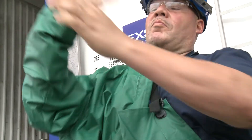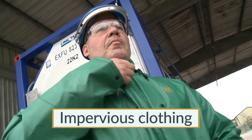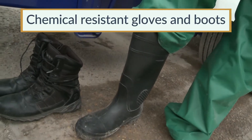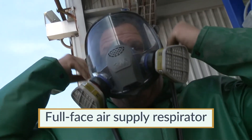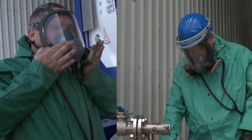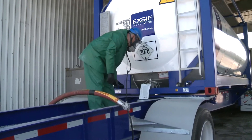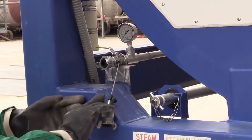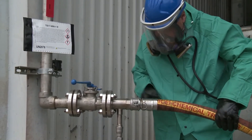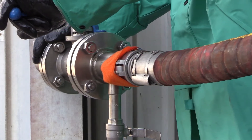In order to avoid contact or exposure to TDI, wear personal protective equipment during hookup and disconnect activities. This includes appropriate impervious clothing, such as a chemical protective suit, chemical-resistant gloves, and boots, as well as an approved full-face air-supplied respirator. Both the unloading operator and the truck driver wear personal protective equipment. The driver will make connections to the tank container and operate the tank container valves and all other tank container equipment. The unloading operator takes responsibility for connecting the unloading hose to the receiving line and operating the valves in the receiving system.